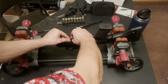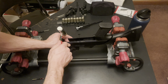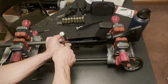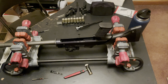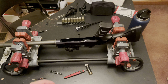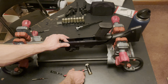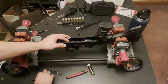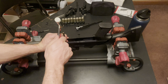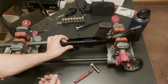I'm going to look down in there and then insert my roll pin. When you're tapping that in, you kind of have to adjust pressure on it to make sure that your shell catch is straight up and down and the hole is still aligned. Sometimes it'll stop driving and stop going down — you just have to adjust it a little bit to make sure it's still aligned. Now I'm going to drive this in all the way. Go ahead and take my roll pin punch, push that right there — see how it stopped — just push it in, making sure you're holding that while you're driving it.